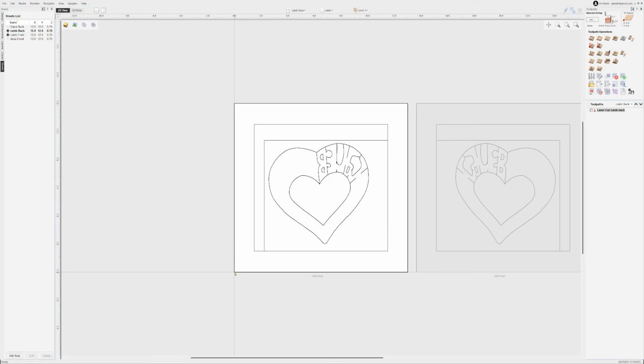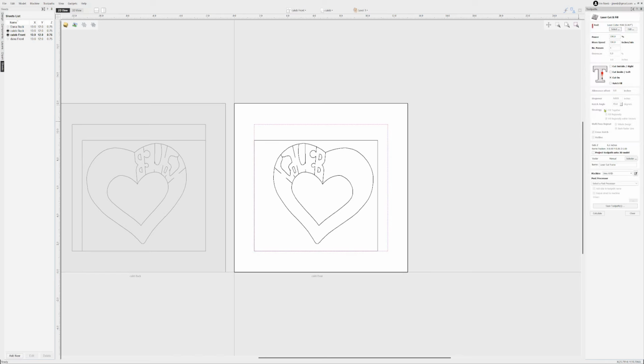So, I'll set my XY boundary down here in the lower left corner, like I always do, tape this piece of cardboard down, and then make a tool path. And so you can see, if I go to the front, I've made a laser tool path for the frame, which is going to cut this hole out in the middle. And it's not really that important how accurate this XY setting of my CNC control software is to this corner position, because if this edge is shifted over a little, it's also going to shift over the project itself. In both cases, the design stays relative to itself, I guess is the way to say it. The internal pieces are going to shift.